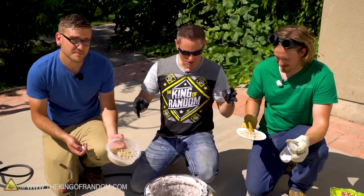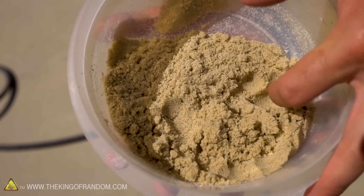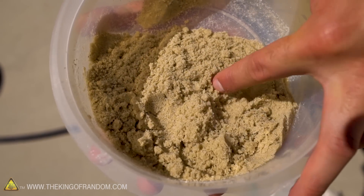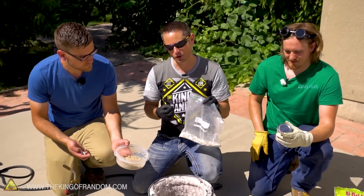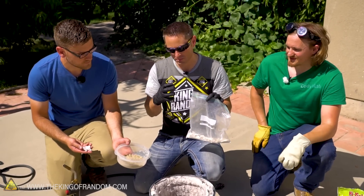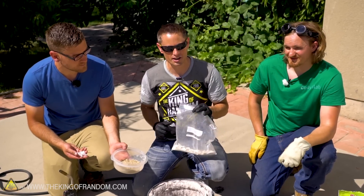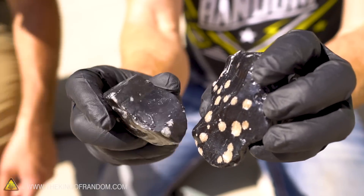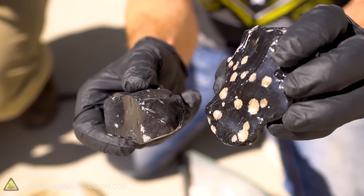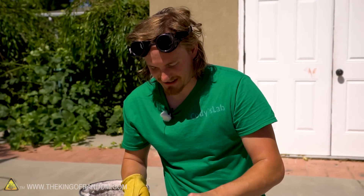The time has come — we're going to take all of these ingredients and mix them together. Here's how: we take this sand that's already had most of the iron washed out, mix it with sodium carbonate, add a little calcium nitrate and a bit of gypsum, crush it all into a very fine powder, mix it together, throw it in a crucible, and let the whole thing heat for about 6 to 12 hours in our trash can foundry. Clear glass is a very cool thing and we're going to replicate it here today.